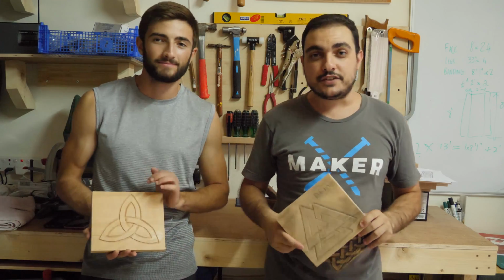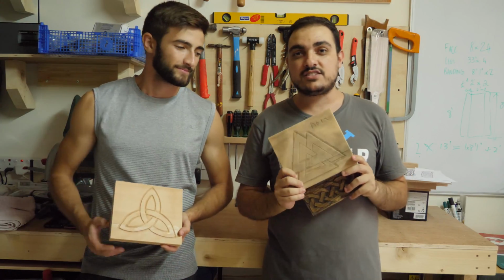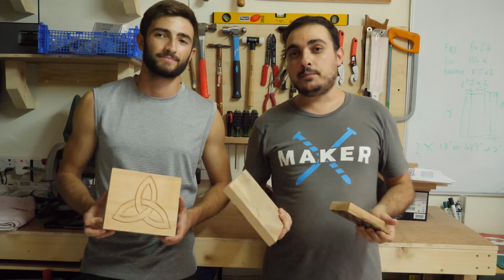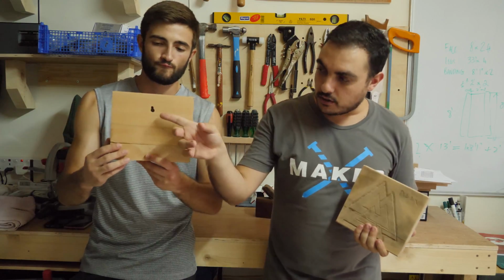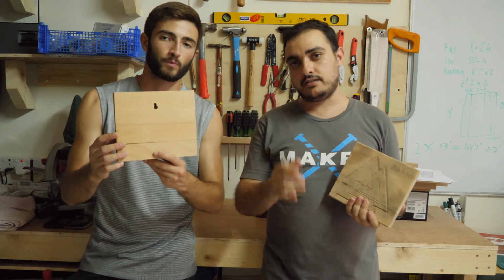As you can see in the video, it's not a particularly difficult project to attempt. If you have access to a chisel, a hammer, and if possible a Dremel tool as well, it will help you out immensely. You just need to sand it in the end to make sure it is completely smooth and give it a good coat of varnish. Put a keyhole at the back so that you can hang it on the wall. It's very easily done with a keyhole bit and the router.